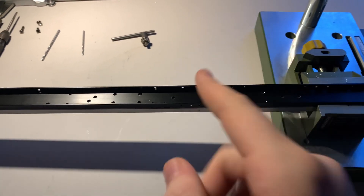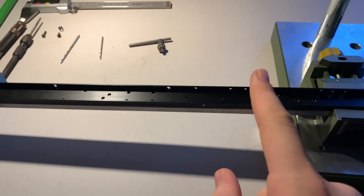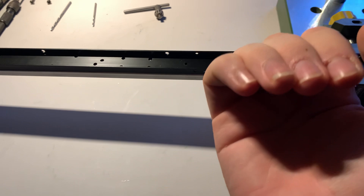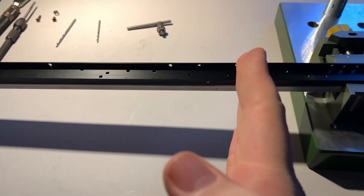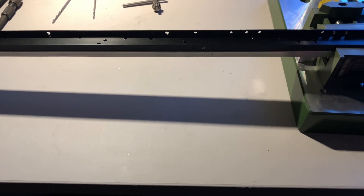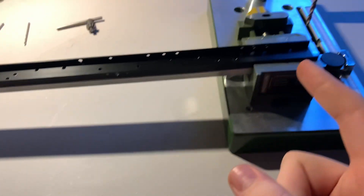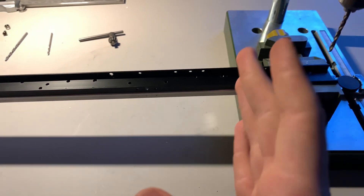When you're drilling new chassis rails for any Tamiya euro trucks — the 770, the Actros, the Arocs, the FH12, the R620 Scania, or the 470 Scania — these four holes here are used for servo mounts. You have a pillar that brings your servo linkage from the top to the bottom of the chassis, and when you drill these it's definitely on the wrong side, which can affect your steering.